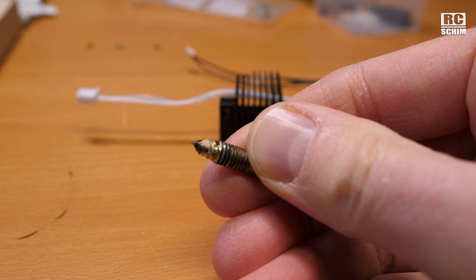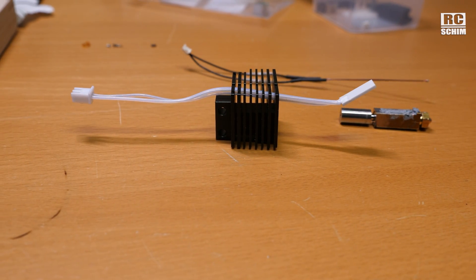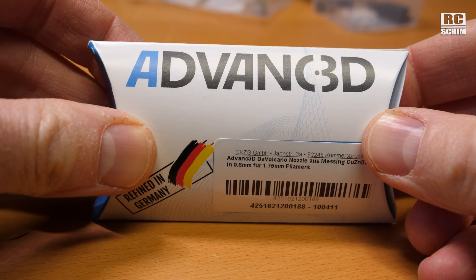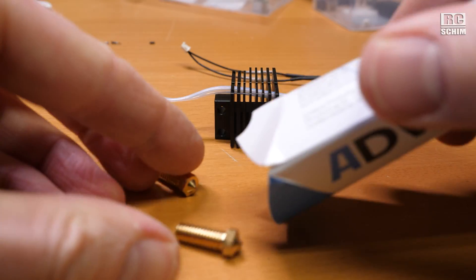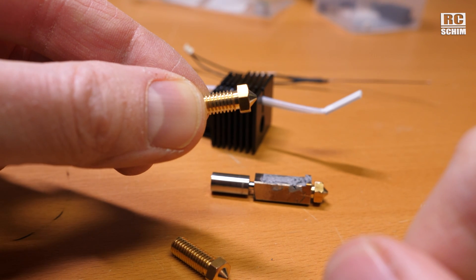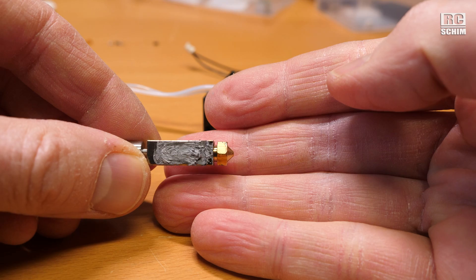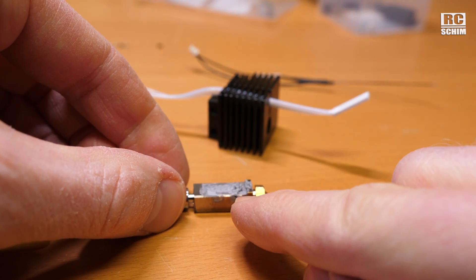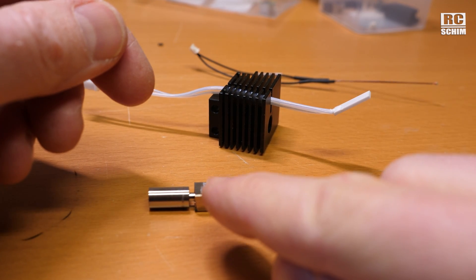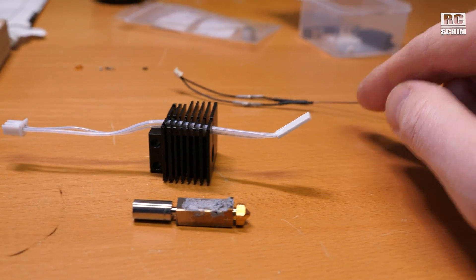The quick and easy fix to the tray not being grippable is ugly scratch marks to make it grippy. Next I'll get a bigger nozzle — for bigger prints a 0.6 nozzle. I wanted to change the standard 0.4mm nozzle, which is a volcano-style nozzle as I've learned. I found replacement nozzles quite cheap. Today I installed even the 0.8mm nozzle. There is a small gap in front — I couldn't screw it in further — but a new Z offset and that's it.